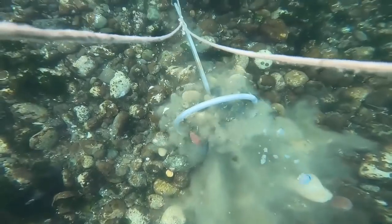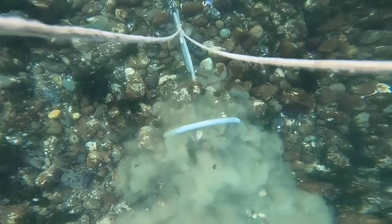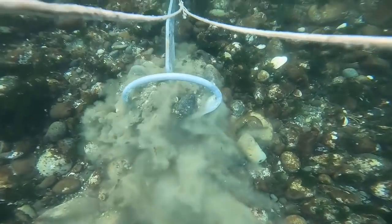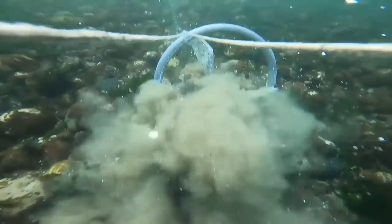I held that 250-pound thrust for quite a while. At some point toward the end, I increased the thrust, and then it drags faster. So not a lot of change, just possibly a hair less holding because of the downturned fluke.